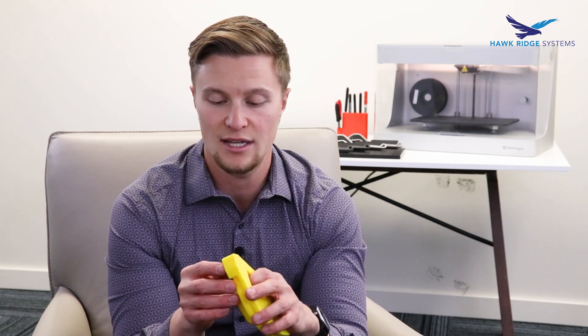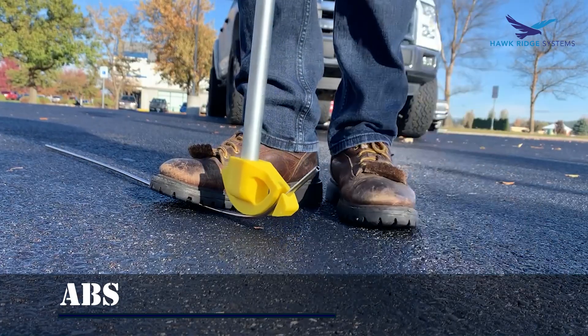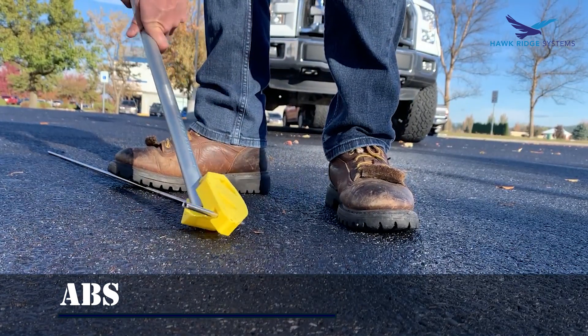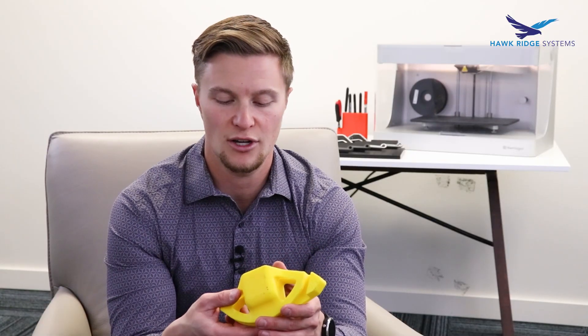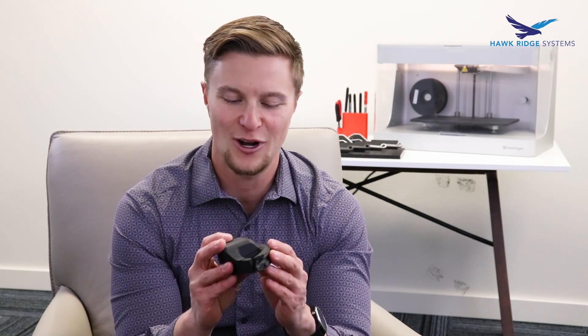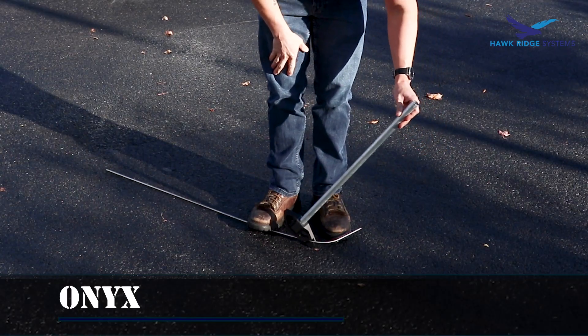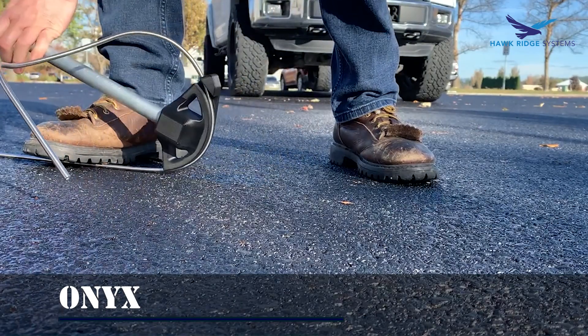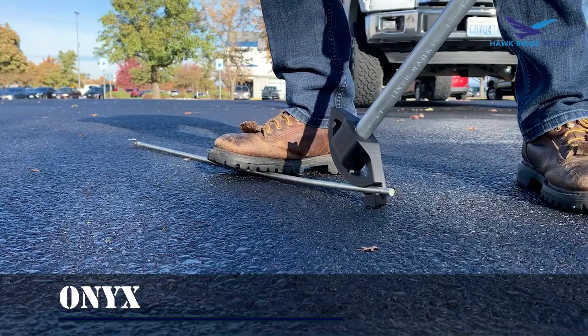We did get a bit of delamination as you can see, and it didn't hold up too well under the conditions for actually bending the tubing. The failure point is a little bit different compared to the other two models. Better to step it up to a different material like Onyx. I was really impressed with Onyx — it held up pretty well for the application it was designed for. Quarter inch tubing is going to have no problem with this material, and we could get multiple bends out of it, but as we started to use larger stock, obviously it wasn't quite designed for that application.